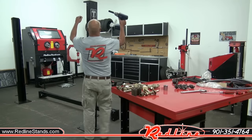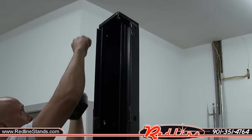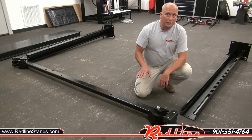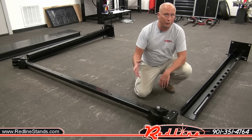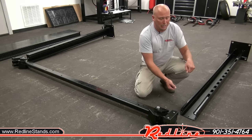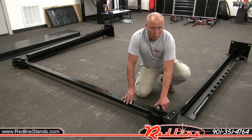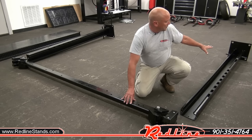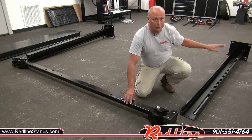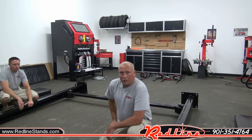We're going to lay both towers down and take the caps off. Now we're going to go ahead and assemble the H-frame that the runways sit on. We're only going to show you this on one end because it's identical on both ends. Turn your tower up on the side — you've got these automatic locks, so when you go to slide it down into the tower, you have to keep those pulled out of the way. For assembly, slide it down to the very bottom lock. There's about an 18-inch gap between the rest of your locks and the very bottom one. Now we've got that in place, we're going to stand the towers up and put the end caps back on.